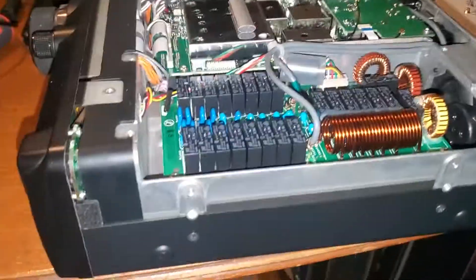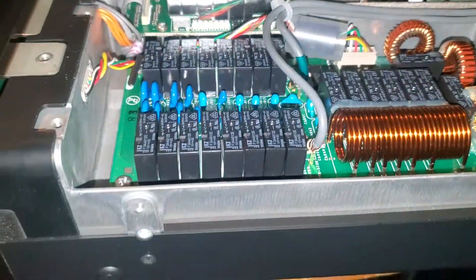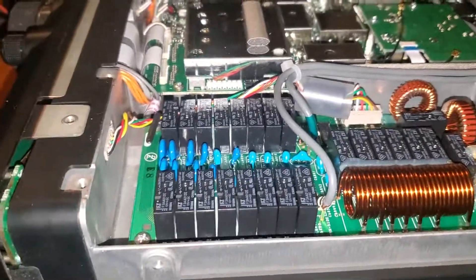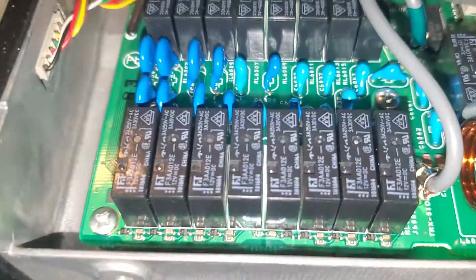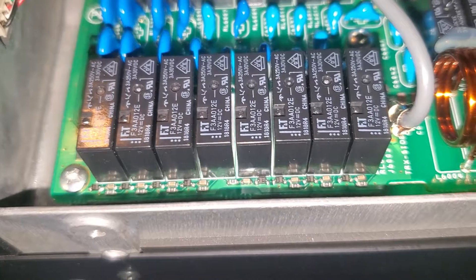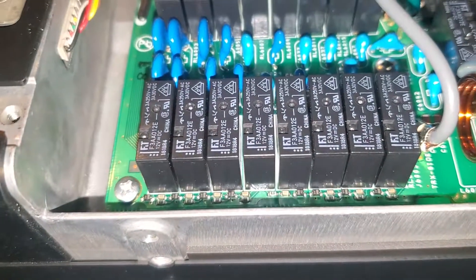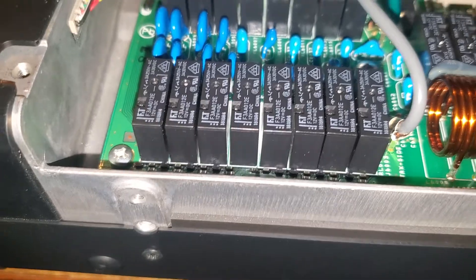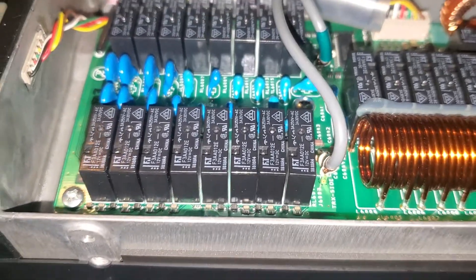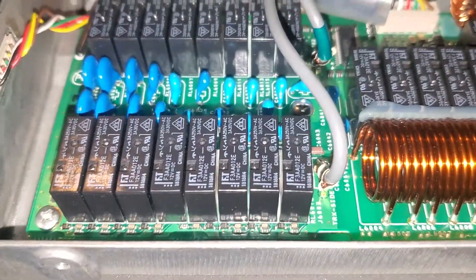You'd take a manual tuner and tune it up to 60 meters almost flat, then try to polish it off with the built-in tuner — but you wouldn't even need to tune it, just turn the tuner off and it would work fine. People said the screws on the backside of the board for grounding have pads that are tinned but then covered with lacquer. They soldered the board first and then sprayed it with lacquer, so you get really poor conductivity on the bottom.